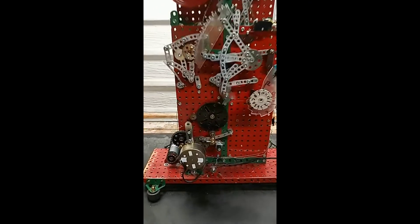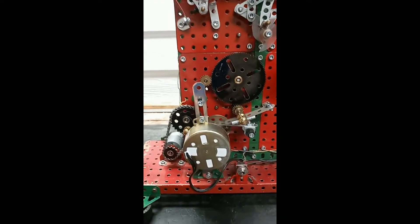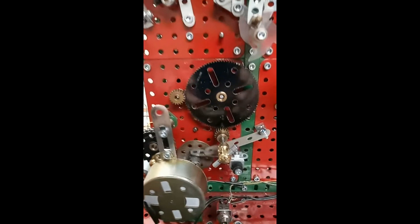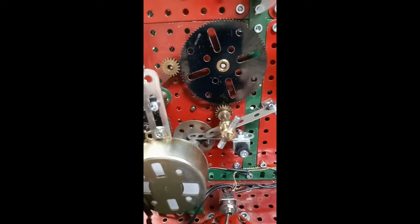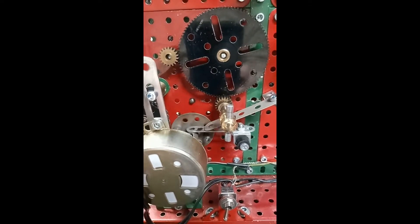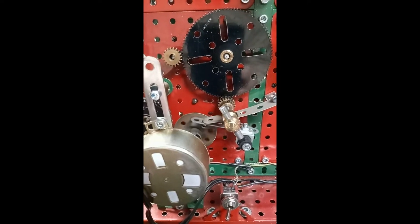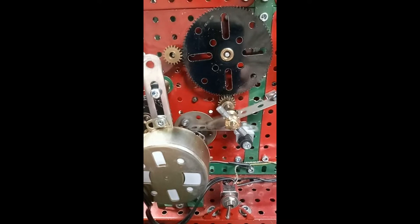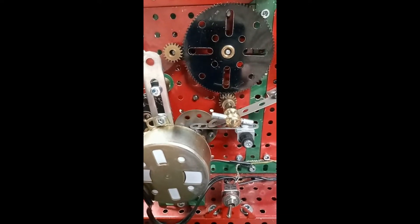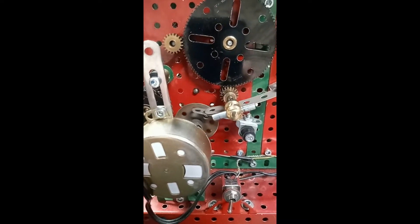The going train of the clock is very simple and it's done with a synchronous motor. Here is a device that gives the clock a tick and it also prevents the synchronous motor from starting in the wrong direction. If it starts in the wrong direction, it's stopped by the little strip there and it just goes the other way. That's what synchronous motors do.